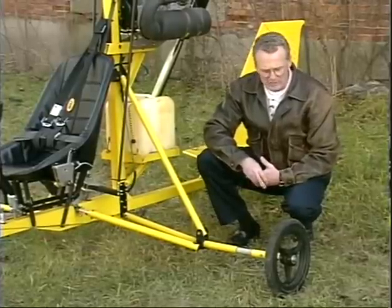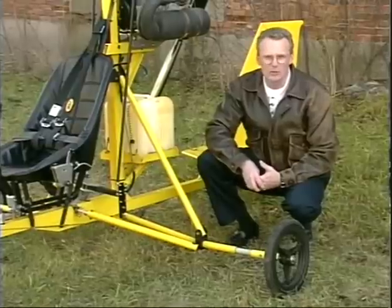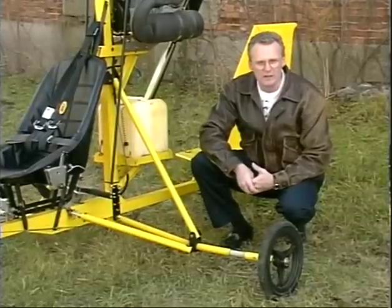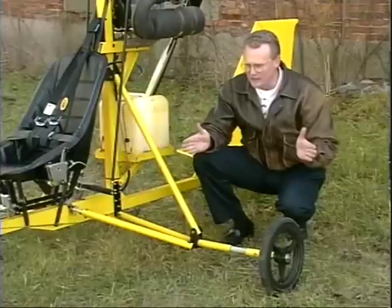When we initially started working with this landing gear, it was very forgiving and very flexible, but at about rotation speed, it gave you a real squirrely feel because the wheel was going aft and it would actually have toe out.